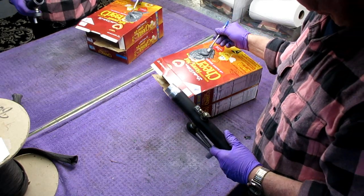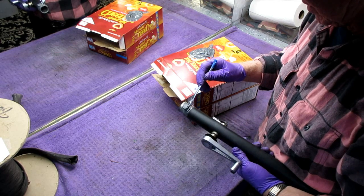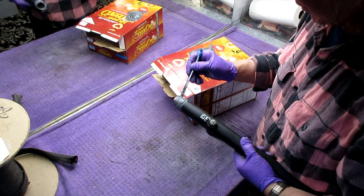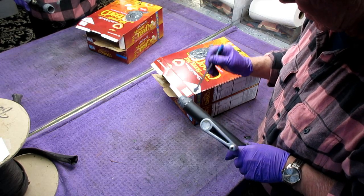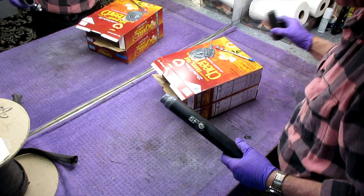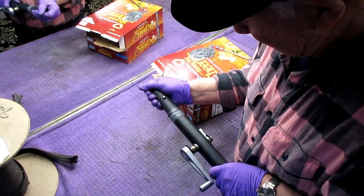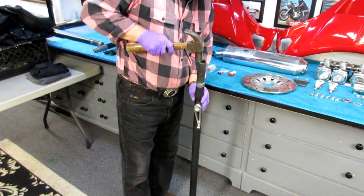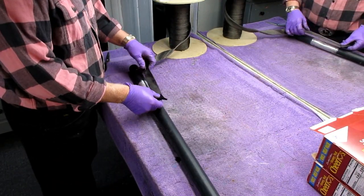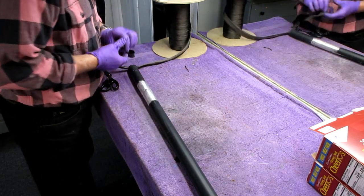What a rip-off that they don't sell you these parts — they want you to just go buy another umbrella. And these things are expensive. This is an 11-footer — go price it out. Always butter both parts if you're doing a JB Weld job. Keep in mind that heat makes it thinner so it penetrates better. You wouldn't want to do this out where it's 30 degrees — it's probably 40 to 45 out there right now. I want to fill in where that gap is. It's just a little over 60 degrees in here, so I don't want this to go off in a big hurry.